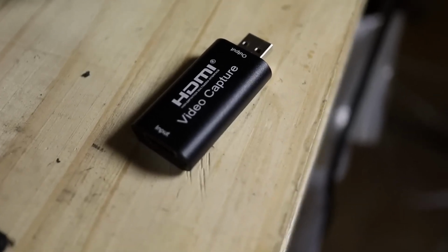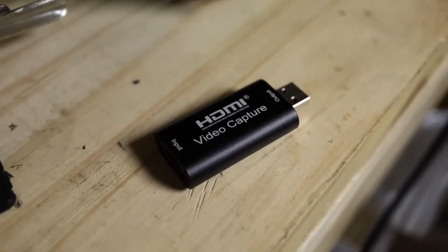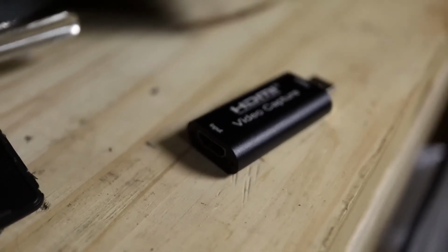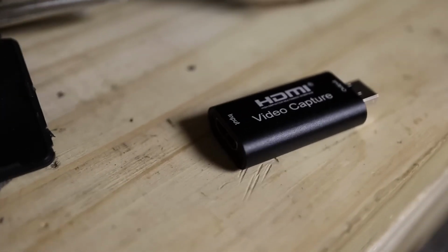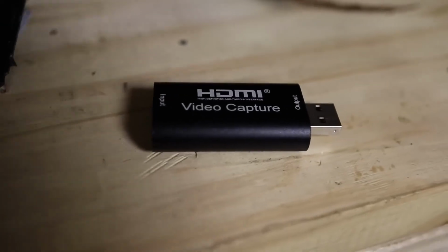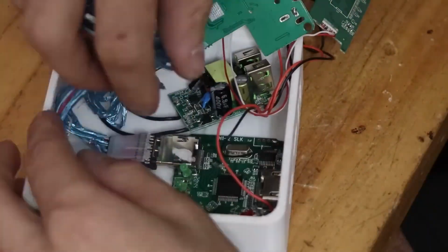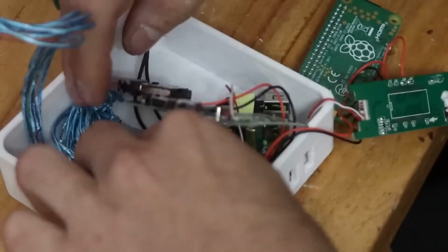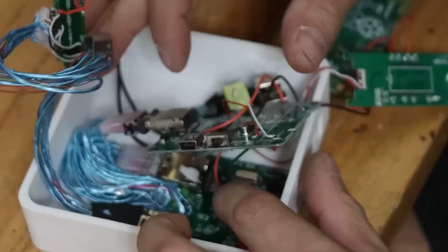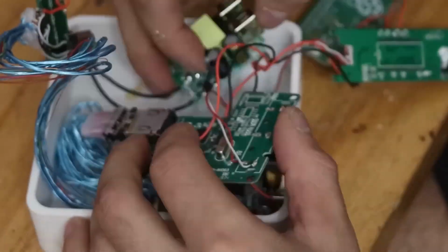Another thing I did was to change the HDMI to Video Graphics Array converter, and from Video Graphics Array to USB, to simply an HDMI to USB board. This saves space and money, but why don't I recommend you do it? Because these have greater incompatibility issues. Although if you want to try exactly with the one I bought, I also leave a purchase link in the description.